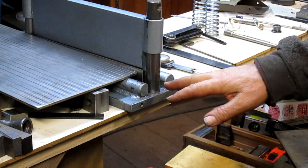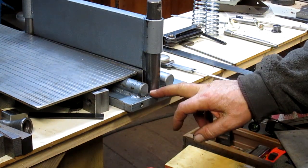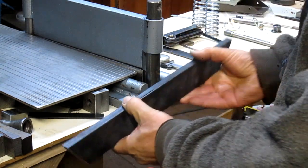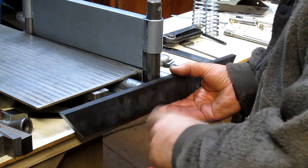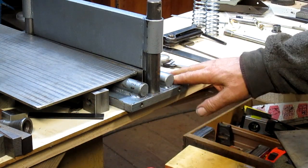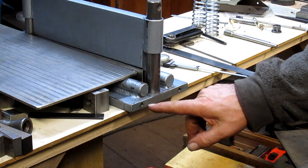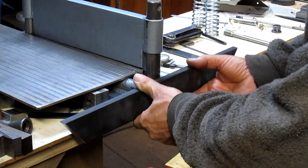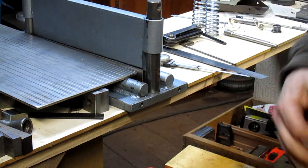All right, so we've got our plate, our platforms, and what I need now is a support for the platform, and what I came up with is these 2 pieces of 1/2 by 2 inch, which is just about the right height. It's actually a little bit higher, so I'll have to probably mill this off a bit. But while I was working on this base and milling the bottom and the receiver area, I put 2 holes in the end on both sides so that this bracket could land somewhere in that general area. So we're going to take a measurement of those holes.